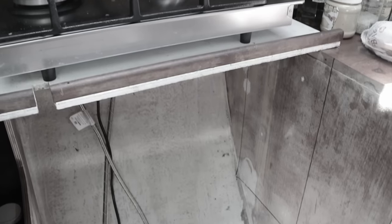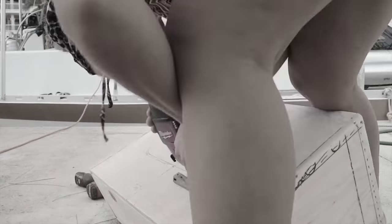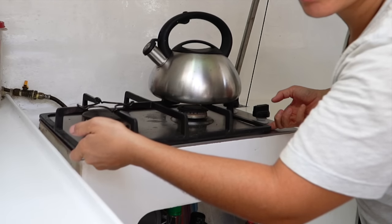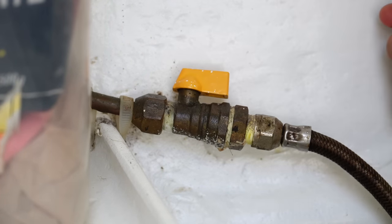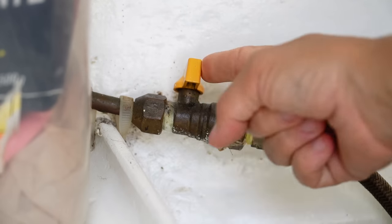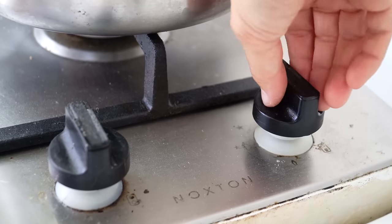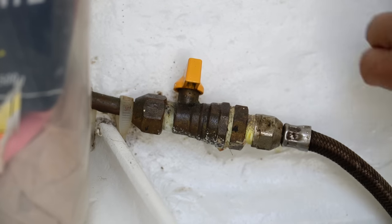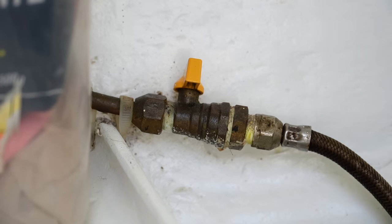The original marine stove was toast, and the alternative cheap one that we bought was not meant to gimbal. We placed some metal weights on the bottom to help it gimbal. The biggest drawback right now is that the pots and pans can fall off, so we need the metal shop to make a better grill and pot holders. This is our safety mechanism for our propane stove — open to cook, close when you're done. We also have a second valve outside in the cockpit, and the ability to close the valve on the stove itself. So that's actually four mechanisms — the fourth valve is on the propane tank — all stopping the gas.